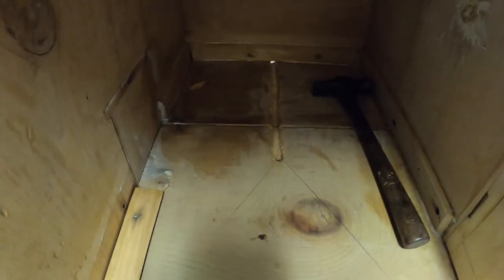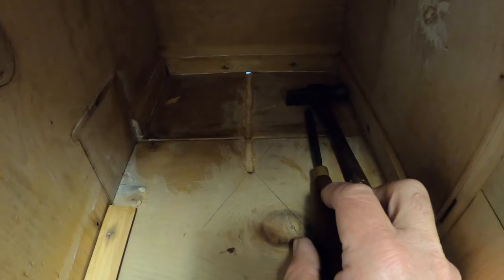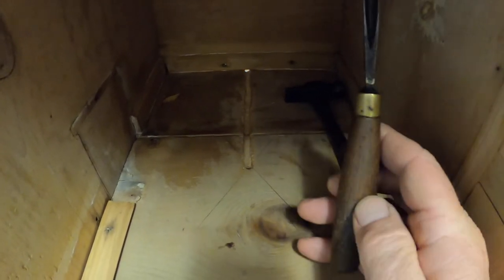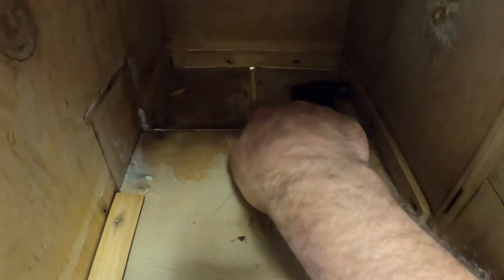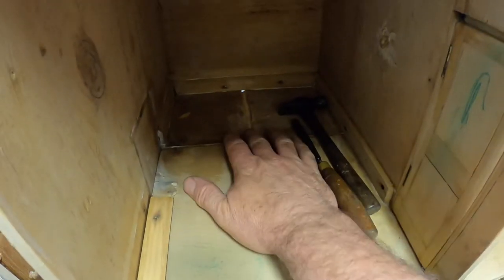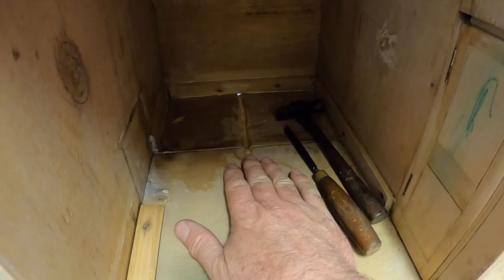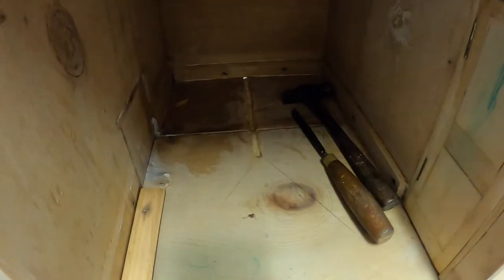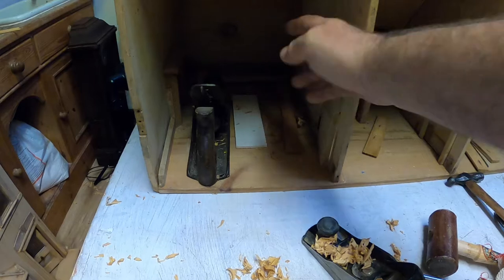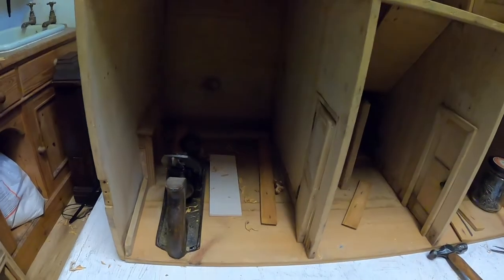As you can see in this room as well, I have routed out the floor. I did it with one of my great uncle's old chisels — John Middleditch's chisel. So I have routed that out, and that is for the lighting for downstairs. I will run electrical cables through that, drop the cables through there, and then pop the floor over the top to hide it, which means that underneath, in the room down here, we can hang a light.